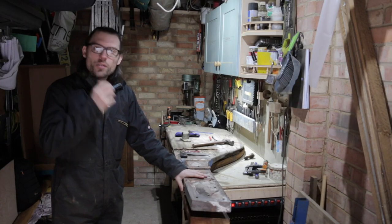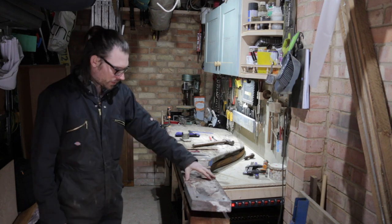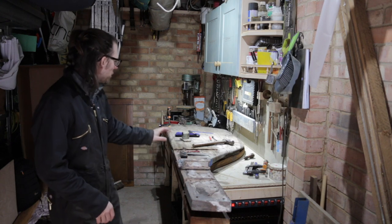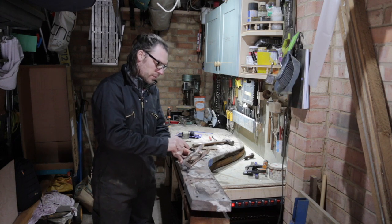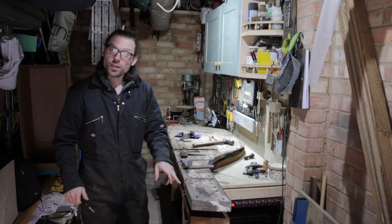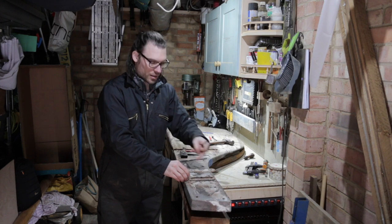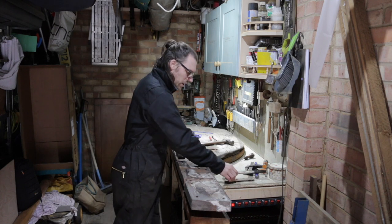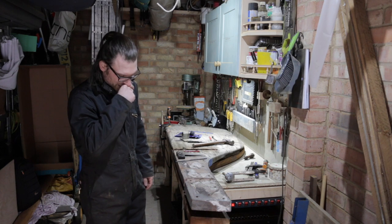Okay, I've lined up the rudder, old versus new, as best I could, and I've drawn some lines on here. I've measured this. I actually used a punch that only just fitted through this. Okay, and I've gone through the holes here and marked on the new rudder where those holes fall. That then has allowed me to lay this in line with those holes and draw around it. I've used a T-square to double check things, and I'm pretty confident that my pencil mark on this new rudder underneath is now exactly where it needs to be.